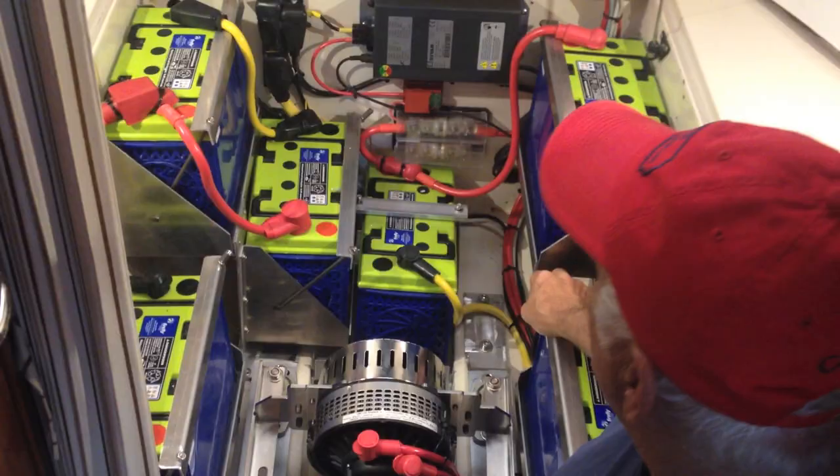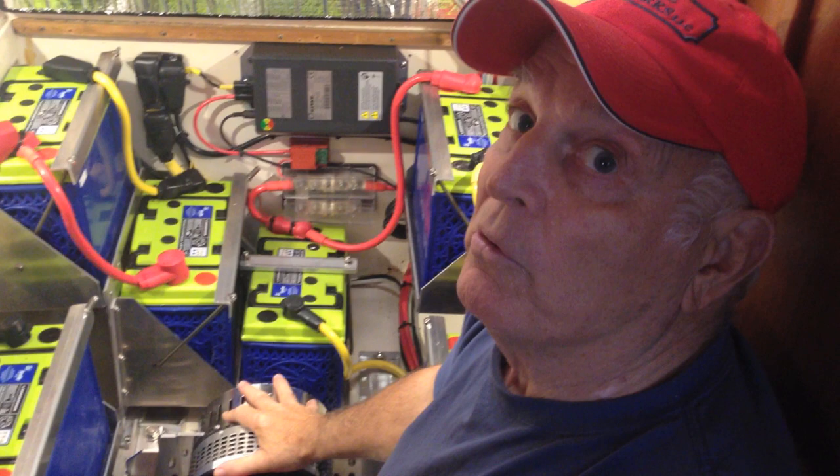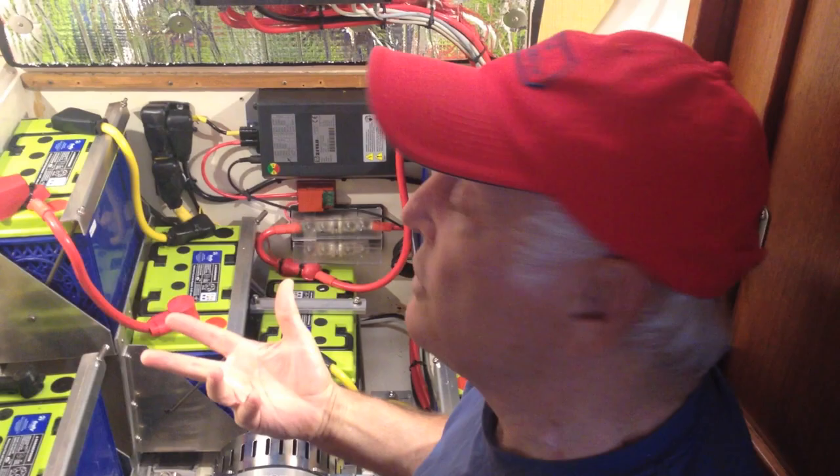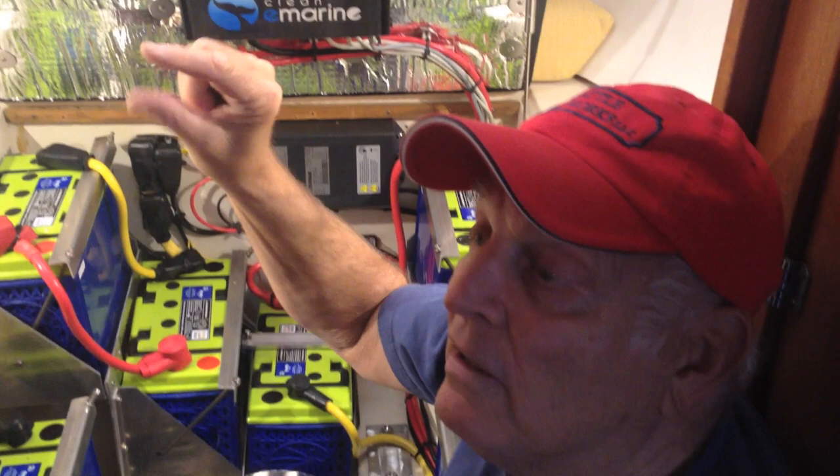The heart of this is not the motor, but the controller. It used to be that you used a rheostat to control an electric motor, but when you use a rheostat you're virtually just spending electricity for nothing, just creating heat. What this does is it actually chops up the DC into little packets — it's current controlled.